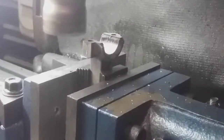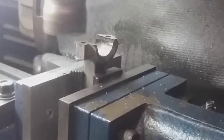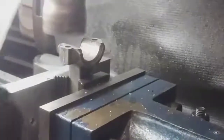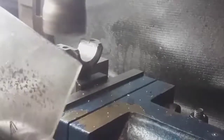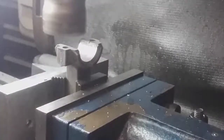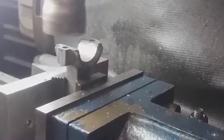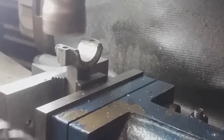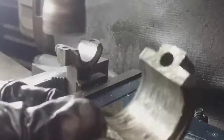I don't think that's very much. I'm just kind of guesstimating - I haven't done a whole lot of this. I know how they do it, but that wasn't much for a cleanup cut. I'm going to probably do another five, maybe ten on both sides. You can see how much galling there is - it ran out of oil. The oil slinger broke off. I don't know if I'm going to try to replace something or just put a different pipe in there and run a higher oil level and let the bottom of this dunk in the oil.